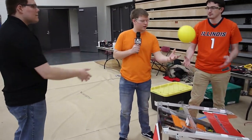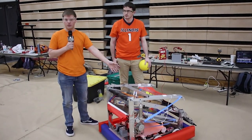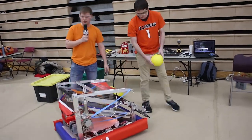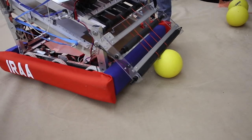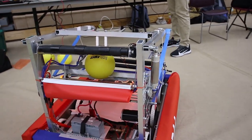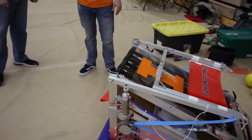Our goal was really to make an MCC robot — a Minimum Competitive Concept. We wanted something simple that any team could produce that would still contribute a lot. Our strategic decision was to focus on low goal and climbing. Our system is fairly simple: we've got an over-the-bumper intake in the back that uses VersaRollers with neoprene rubber over the top, pulling the ball right over the bumper into the robot. We can take in up to five balls, then clamp down and outtake into the low goal.